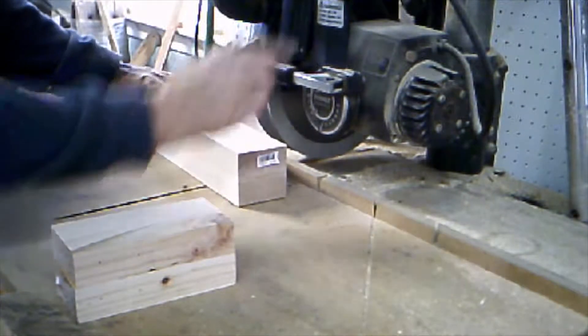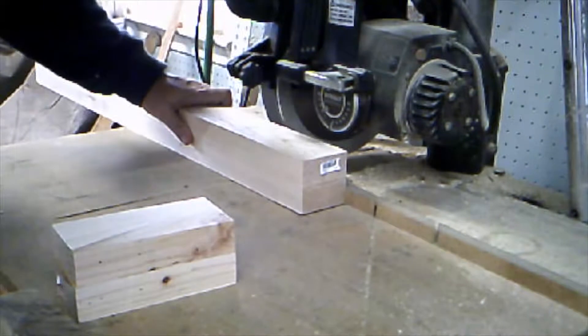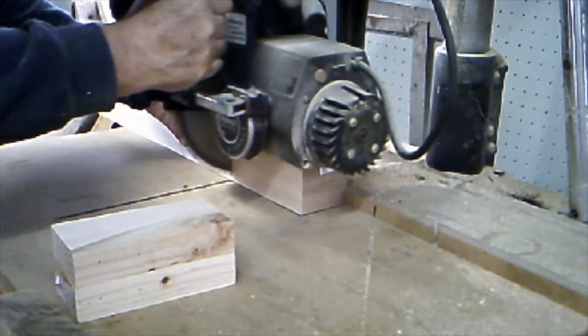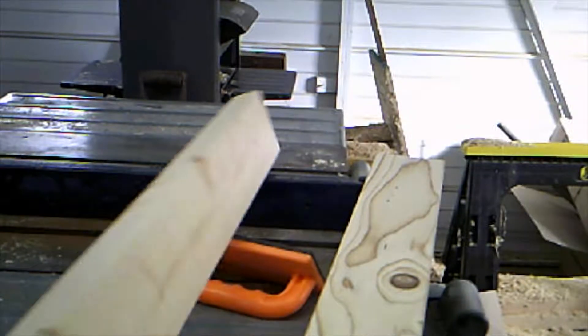Once we get the legs pretty close to where we want them and squared up, I trim them last. I try to use larger pieces and with each step they get a little bit smaller, so I don't want to trim too soon. Now that I've got the legs pretty squared up and I like the seams, I'll go ahead and get my square cut at the end. I always start with a little more material than I need because mistakes can happen — I lost a chunk going through the planer and now I've got a quarter inch to trim down. With each step, look at each side; you never know what a nice pattern might turn up — make sure that's in plain view when the table is all together.